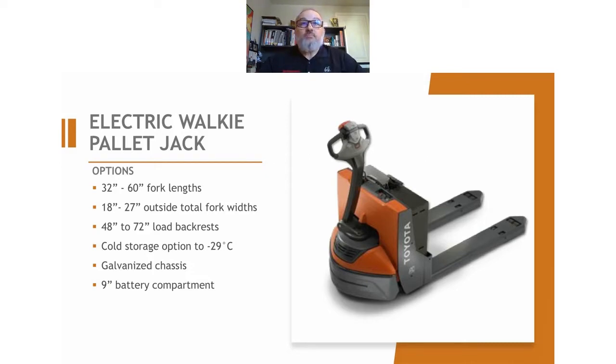You also have a click-to-creep feature on this, which is a great feature for tight areas like docks and lift gates. A lot of delivery guys will use it. You can pinwheel with it. With the handle up, you would click twice on the toggle, and that would put it into a creep mode. You can actually operate it with the handle up in an 85-inch aisle — very versatile and very slow, so it's very safe. When you want to come out of it, just leave it 10 seconds and it'll go back to normal speed, or click back out with two more clicks on the throttle. So that's some of the features on it.